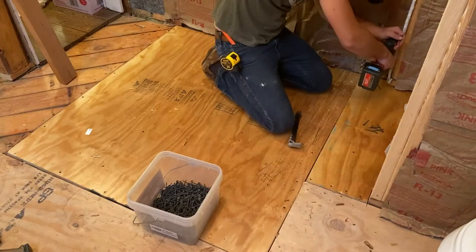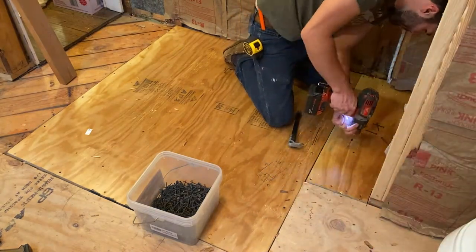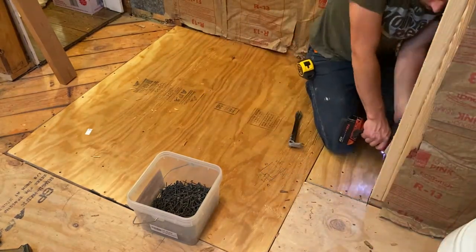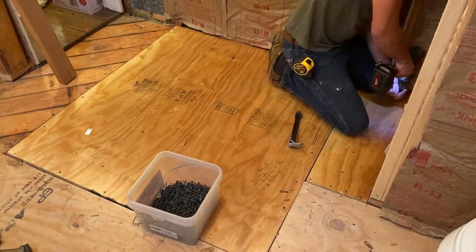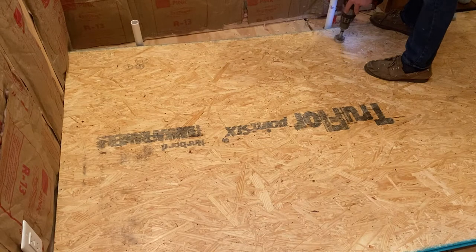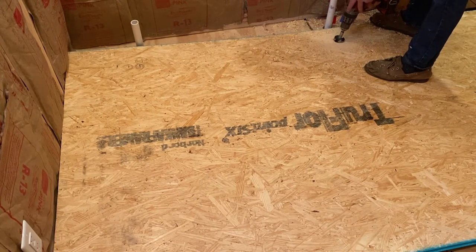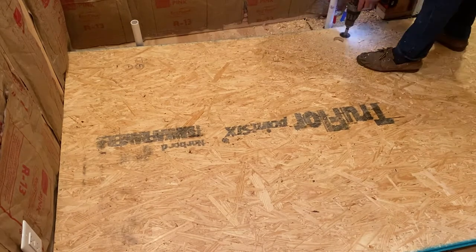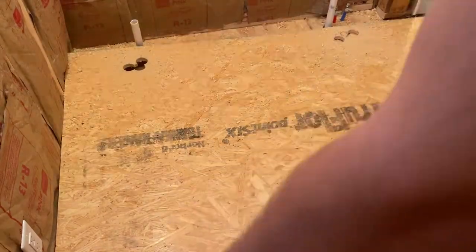Now when I'm doing the subfloor over top of this to make it all level, I'm going to do that in one solid piece because it just butts right up against the two-by-four wall and it'll tie everything together really well. That's all repaired — now it's time to install the subfloor. The room is a little bit shorter than eight feet so I trimmed this before bringing it in so it fits exactly, but I need to now cut holes for the drains for the new vanity going into the bathroom. I find it a lot easier to bring the subfloor in, set it down, and cut out any holes while it's lined up with the drains so you can account for any small mistakes.